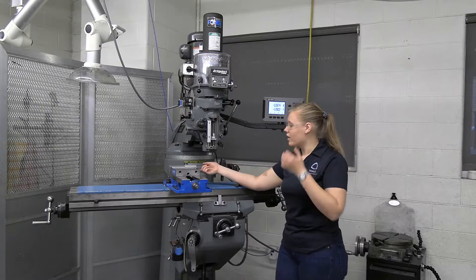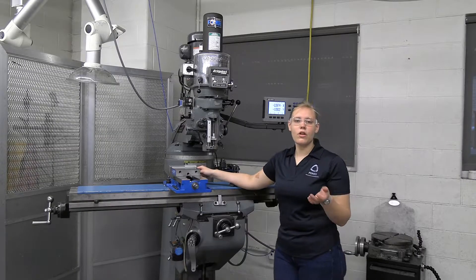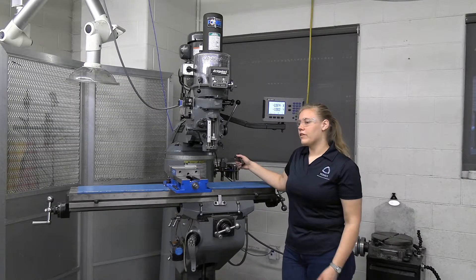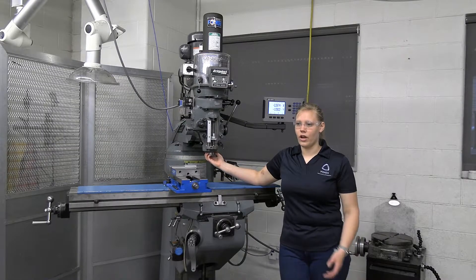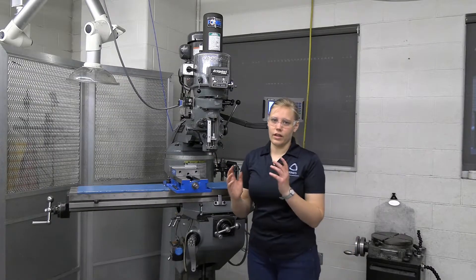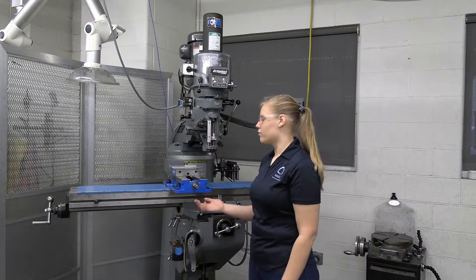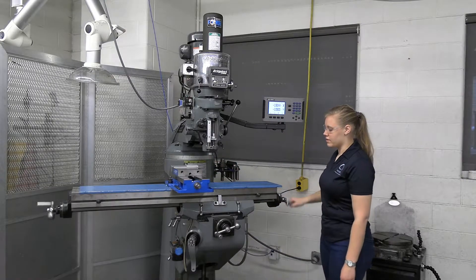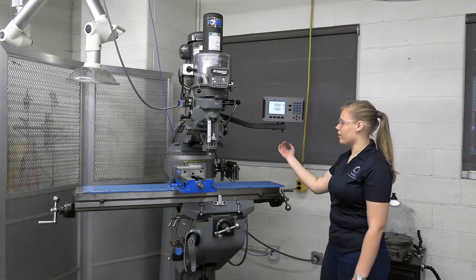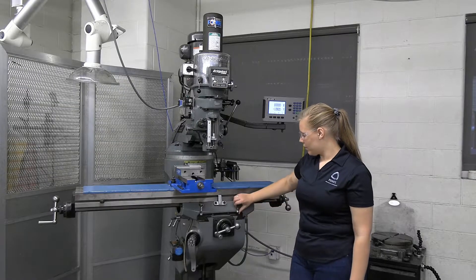It's also important not to hit the vise or the parallels — you never want to drill into the parallel. Sometimes you might need to put a parallel in the middle of your part instead of on the edge if you're drilling holes into the side of a plate. It's also important to keep your hands away from the spindle and the tool at all times. Set up your tool in the best way possible so it is self-sufficient. The way you machine is the tool stays stationary and you're moving your piece in the x and the y. Using an edge finder you can set your zeros, and then using your drawing you can see where all your parts are exactly.